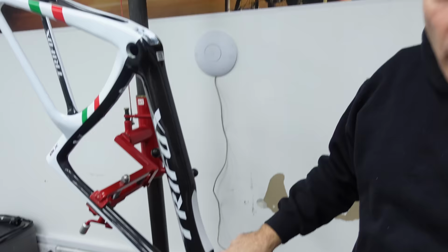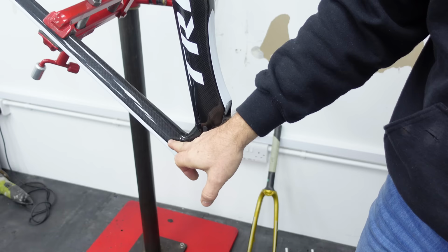If you were to have a head tube fracture, and it fractured there, you've still got another whole chunk, if that hasn't broken, to keep you going. But here you are leaning over the front in time trial position, and you hit a pothole and that cracks, there's nowhere to go. No fail safe. It's basically the rule of one. There's no going back.